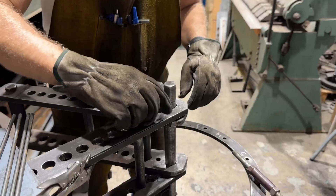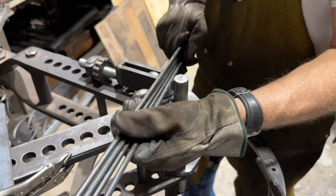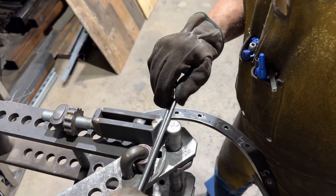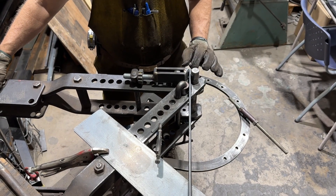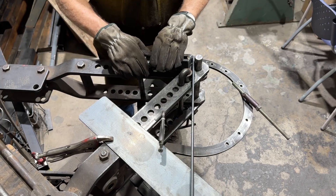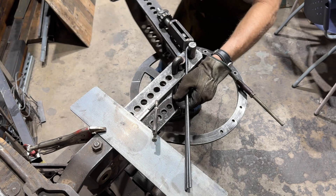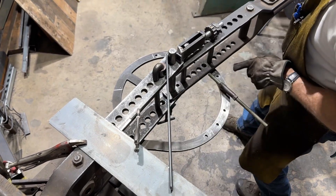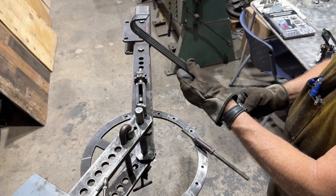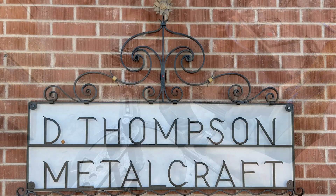Let's get this all worked out — that's my bending setup. I've lined up the front end of my quarter-inch rods in front of the bending dog, about a quarter of an inch. I've got it pretty tight and I'm going to go ahead and bend it to the stop. And we just bent four parts at one time. Let's move on.